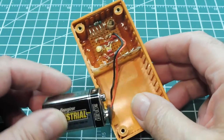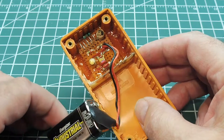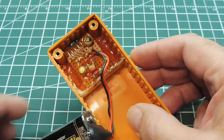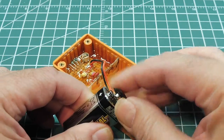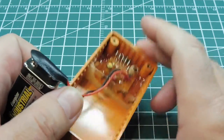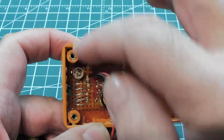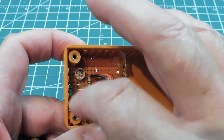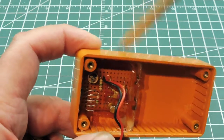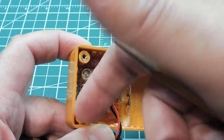I'm going to demonstrate how this works. I have a little nine-volt battery that powers the circuit, and my stereo is on — right now it's on an unused portion of the band so you can just hear noise. When I hook up the battery, it is now transmitting, and any vibration into the spring will cause the transmitter to frequency modulate, which you would hear in the receiver. Any vibration happening will be transferred to the receiver.